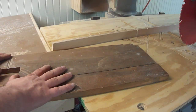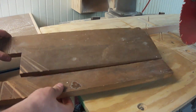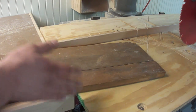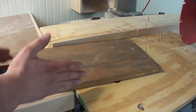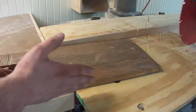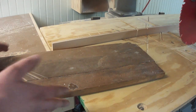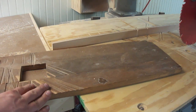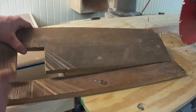Every radial arm saw I've ever encountered comes with 2 or more of these little movable portions of the table. And what they do is give you more flexibility in where you place the fence. The fence gets clamped between these and the main part of the table, and you're free to move it around for different size rip cuts and different operations, like using a molding head cutter and turning it into a shaper, which is what the big notch is for.